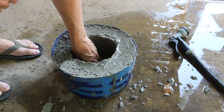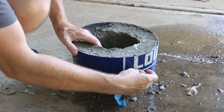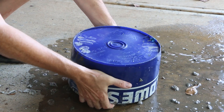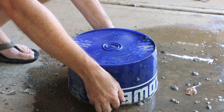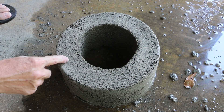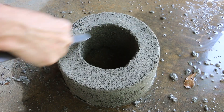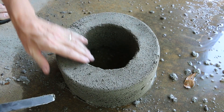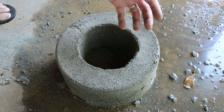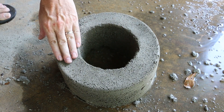This looks like it held up pretty well, other than this one section right here that was a little bit weak. I'm going to get the tape off and see if I can get this out of the form without breaking the ring. Looks pretty good — pretty even aircrete matrix all around. I want to dress this edge a little bit; that'll be easier to do now while the concrete is still green. I'm calling this concrete now versus cement because we've combined an aggregate — the sand and the foam — with the cement, and it's the combination that turns this from cement into concrete.